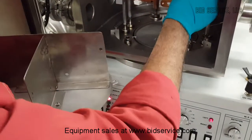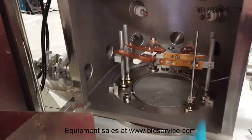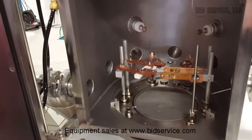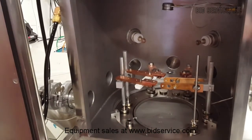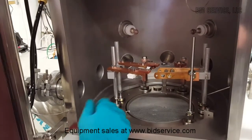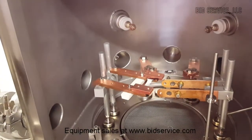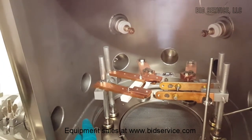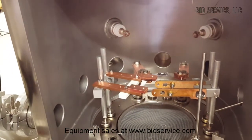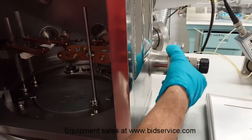Right now, in order to demonstrate all the pocket cooling, I have removed the shutter. Once the shutter is installed, it will prevent material deposition on the crystal during preheat. Care should be taken at all times that the electrodes are not touching the other pair of electrodes — that is very important. All these feed-throughs are currently isolated from the ground and they are wired directly to the power supply.